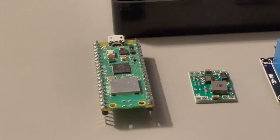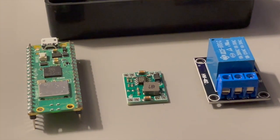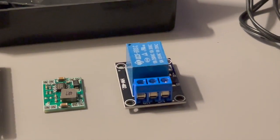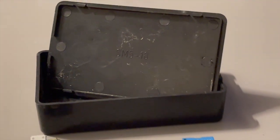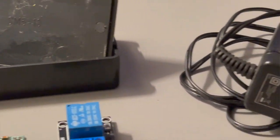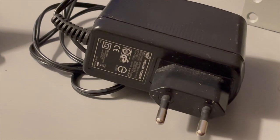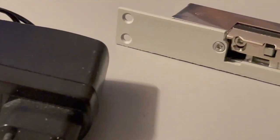Let's start with all the hardware we'll need: a power converter from 12 to 5 volts, since we'll be powering everything from a 12 volt adapter, and we also need a relay to control the 12 volts. All of this will be soldered together on a circuit board and housed in a plastic container, which will go in my utility closet conveniently located right next to the front door.